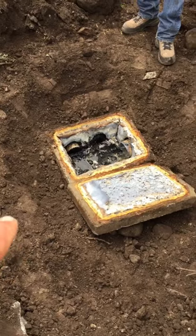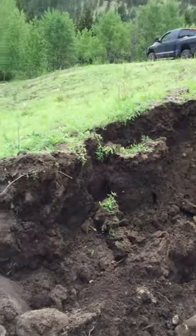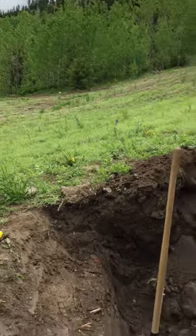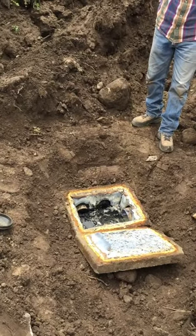We've got some infiltrator chambers leading right out of it. As you can see, those two channels are supposed to receive effluent, but it's going right into the bank. This is exactly what not to do — never put backfill over top of trenches like this, because it creates quite the bad scenario, as you can see.